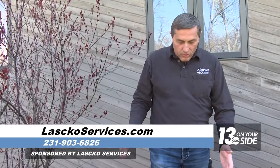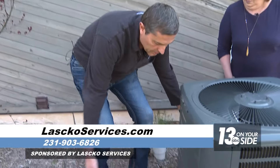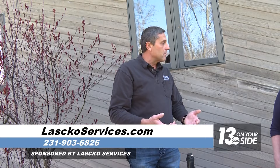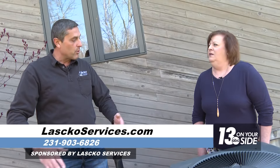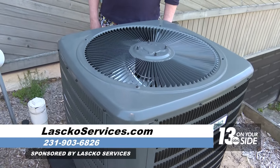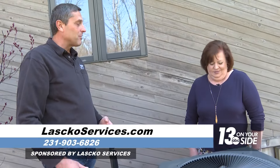As you can see, this tree is just starting to bud out. If it were any closer, once the leaves come in and the unit turns on, air gets sucked in the sides and blows out the top. The closer the trees and bushes are, the more it restricts airflow — it can't breathe, just like when we get stuffed up. Keep vegetation at least a good foot away so the unit can do its job, which is taking heat from inside the house and throwing it outside.